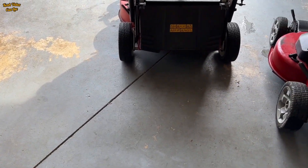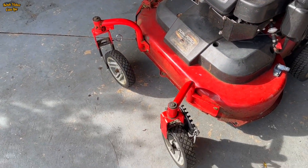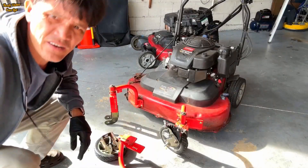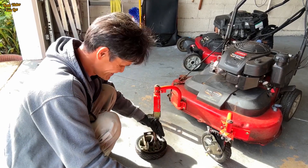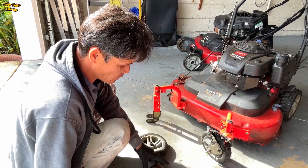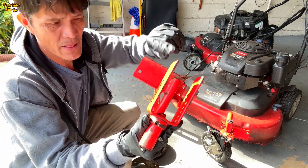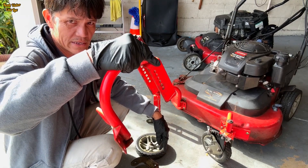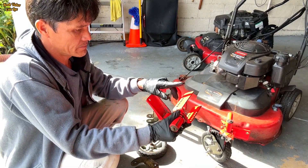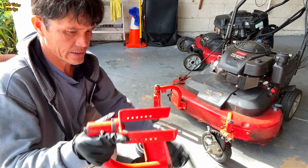Now I will start showing you how I installed the swivel wheels. I will show you the easy way first. The easy way — you don't have to make a hole. Actually, you do have to make an extra hole for this right here, because the Toro deck height is higher than the Gravely 21-inch. That's why I made the hole. If I use the pin to lift up the deck, some customers require me to put it all the way up. If I don't make the hole, the front is kind of low — maybe half an inch — so the grass when we mow doesn't look right. That's why I created one extra hole.